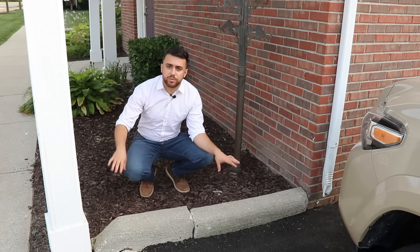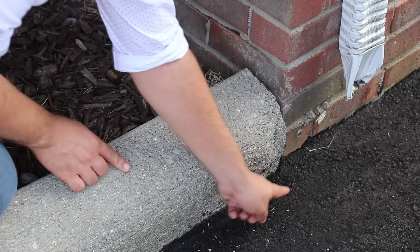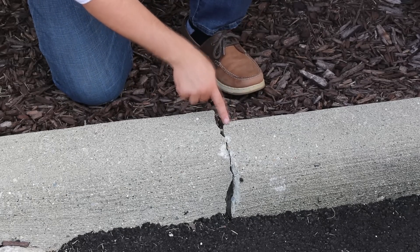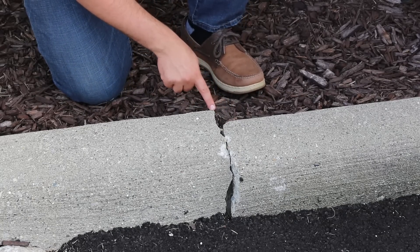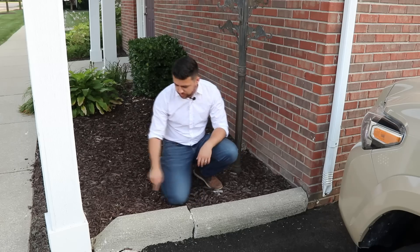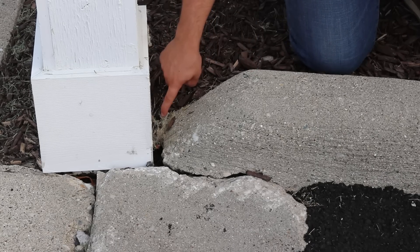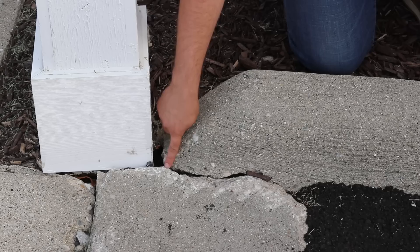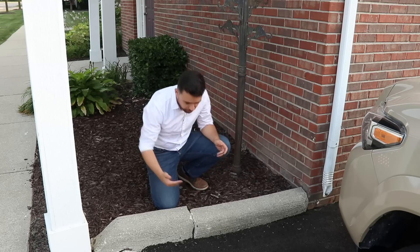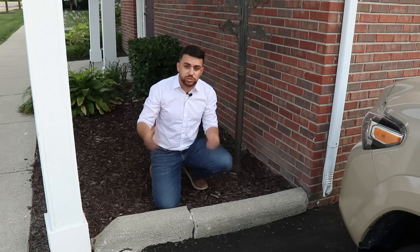This is the strip of curb that we're going to be studying. We'll start by taking a back-of-curb shot, then a gutter shot right in front of it. Next, where the concrete breaks, we'll take another shot there and a shot in the back to capture that distance. We'll also take another shot down here for the gutter, then another back-of-curb shot right before the elevation changes, and then a back-of-curb shot at the bottom along with a gutter shot. These are typical measurements — back of curb, gutter — for a topographic survey, so this is the best way to test the sensor on real industry data collection.